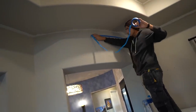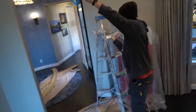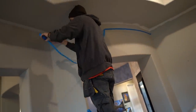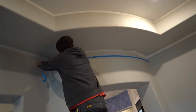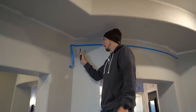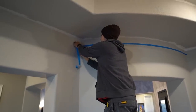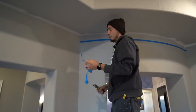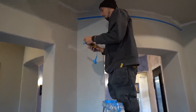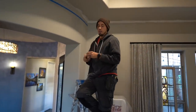Now that the tape is right there on the wall projection of the crown, I'm going to take a sharp blade and cut it right where those two miters would come together. That's why you want to make sure the tape is long enough so you can get a nice sharp cut. When I peel that off, I know exactly where the bottom end of my miter needs to be. I'll go to the other side and do the same thing. This blue tape is an exact measurement of what I need to cut this flex molding to.